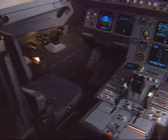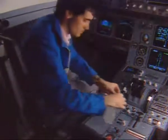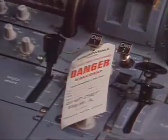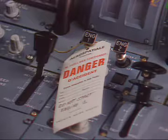Opening and closing of engine cowl doors. Before working on the engine, initial precautions have to be taken in the cockpit. On the engine start panel, check that the master lever is at the off position and install a warning notice stating not to start the engine.